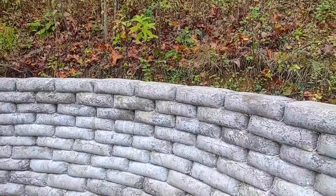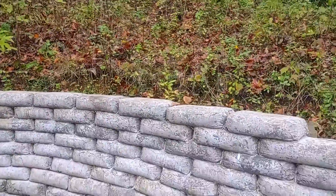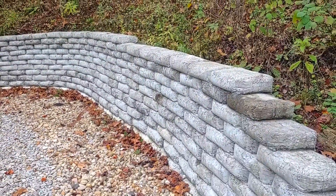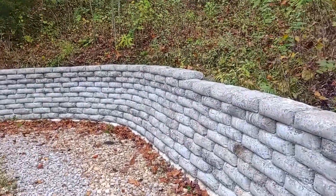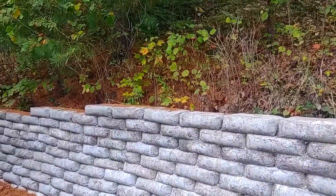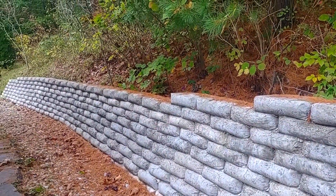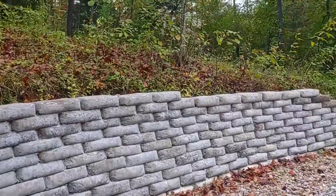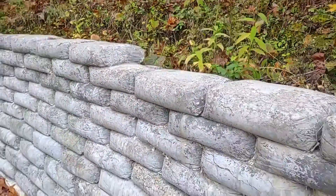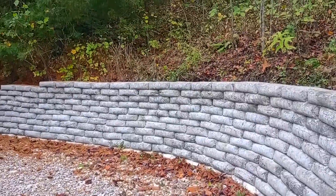This wall is not going anywhere. A lot of people say I'm holding up this whole hill, but this hill has been established for probably hundreds of years. I only dug into the side of the hill and took out a little bit of clay — it's solid clay. I think people are overthinking it. I'm only going about two and a half feet up, supporting dirt, and a lot of it is just rock I put behind the wall. I recommend talking to someone to make sure you're doing the right thing — putting in tie-backs, geo-grid, or whatever is recommended in your area — but this wall hasn't changed except for the bad spots where I didn't mix the bags.